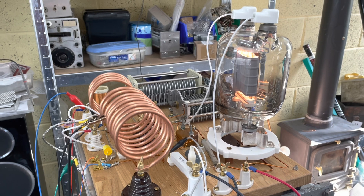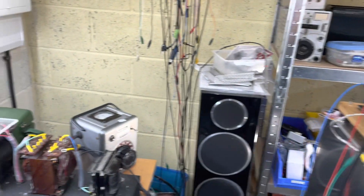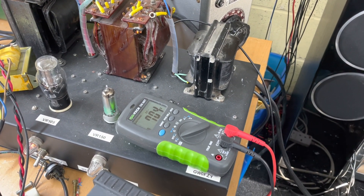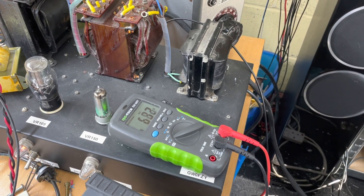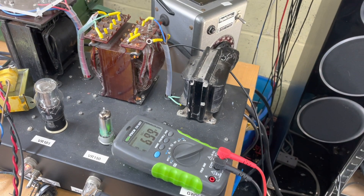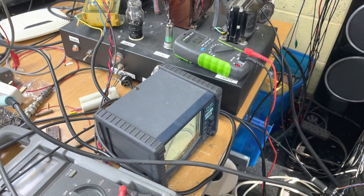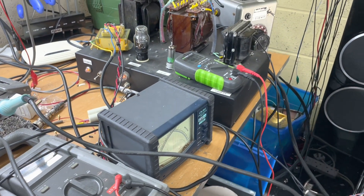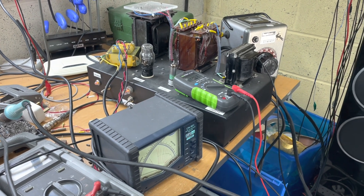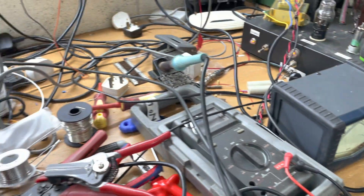Right, so I've turned everything on — this thing is a bit of a death trap so don't try this at home. We've got 700 volts there on the anode. Let's key it — it drops by about 70 odd volts. There's a bit of a rough tone; I think there's some AC or RF on the note there, but that's more due to going into the dummy load which tends to get a bit of RF into the receiver. Connect it to the aerial where everything's grounded and it doesn't sound too bad.